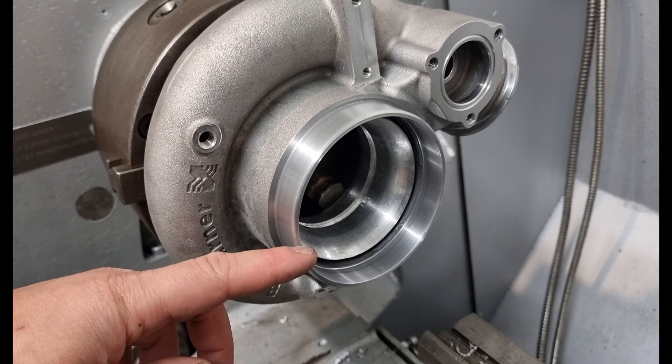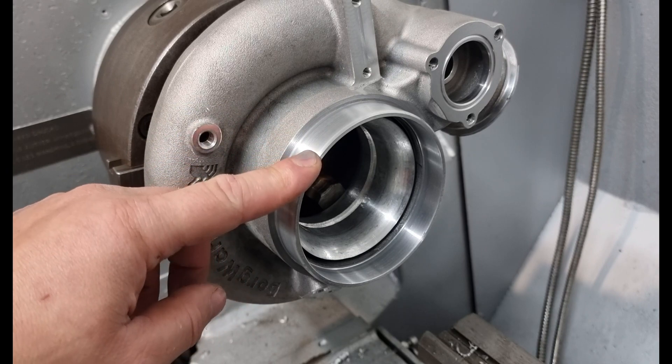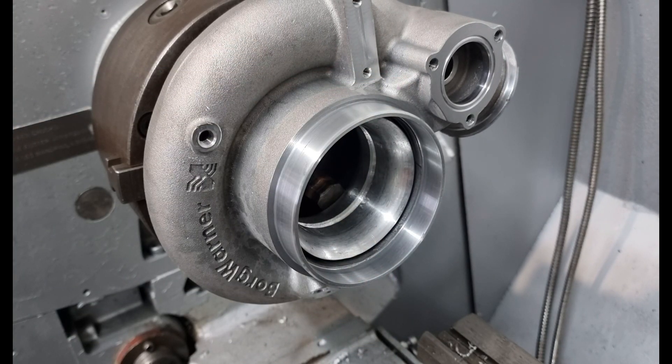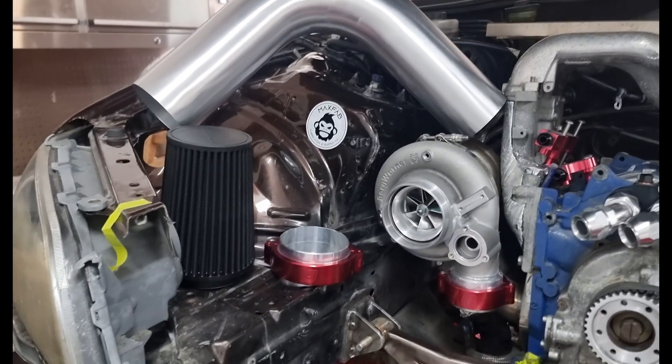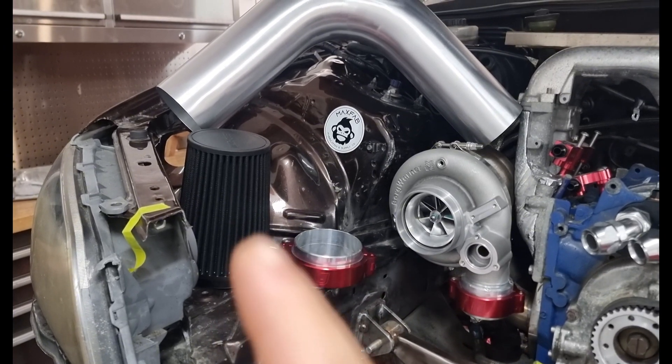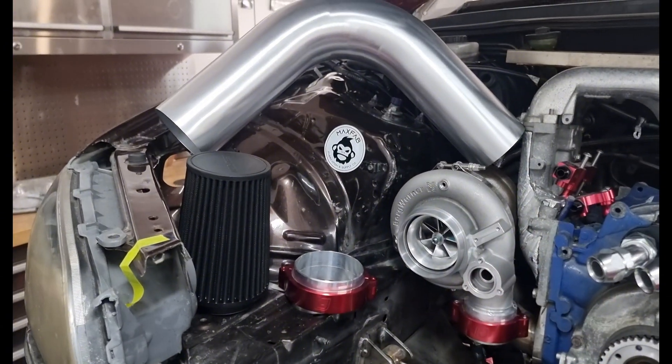Here we have it all done. We parted the ring, put a little 45 degree chamfer on there, just deburred it. Now we're ready to weld on the Wiggins — real simple filter setup. We'll weld the Wiggins to the inlet.